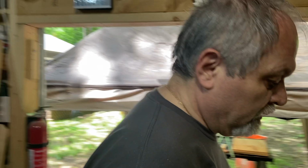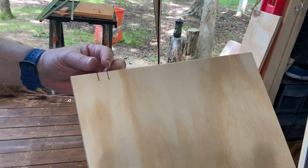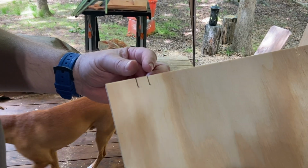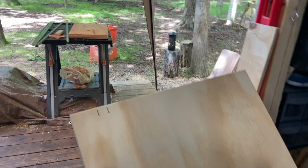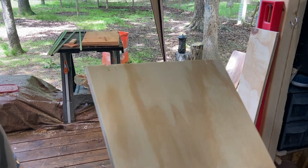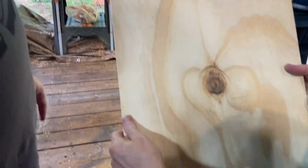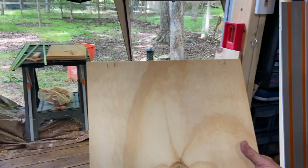So what did we do? All right, so we're making 2 small cuts, so the channel of our channel aluminum will go in here and it will be flush with our front. We're going to have to make 4 of those on each of our panels. Right, so far we've done 2. We've got to do the bottom side on this one and then 3 more boards identically.